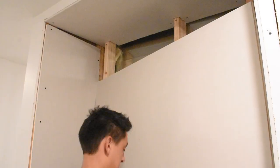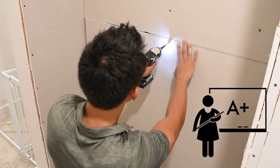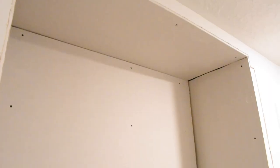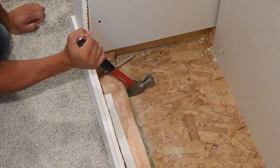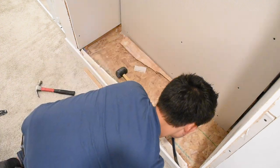For the back: measure the height, measure the width, cut the sheetrock, dry-fit it, and fasten it down — and also do the bottom. I'd recommend getting a sheetrock grater for sanding. I did it in two pieces so while fastening one I could see where the stud was. For the bottom, you already have your line. I then realized I needed to remove a stud for a level surface, so I cut it, used my pry bar, chipped away at it, and pulled it out. I also removed excess sheetrock from the baseboard.